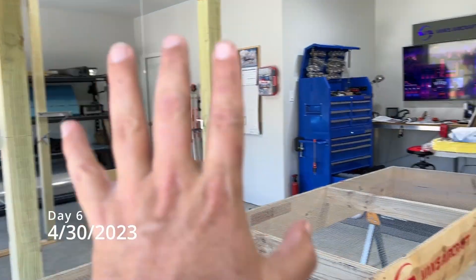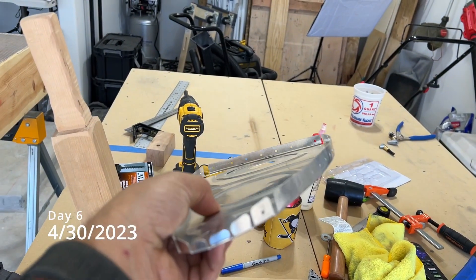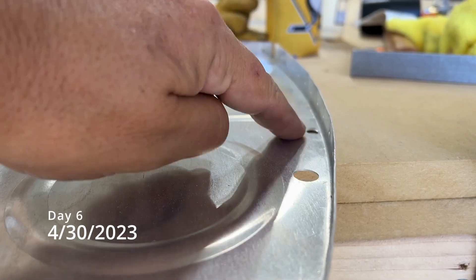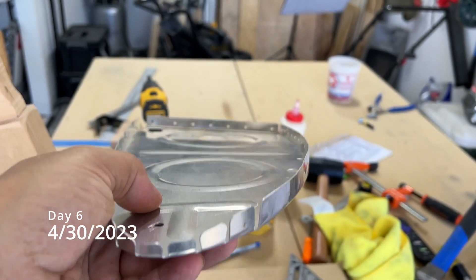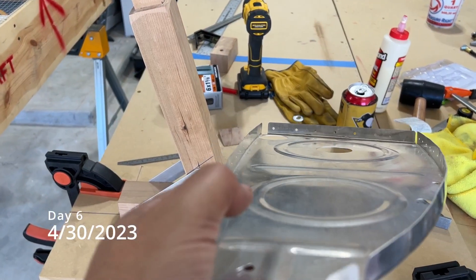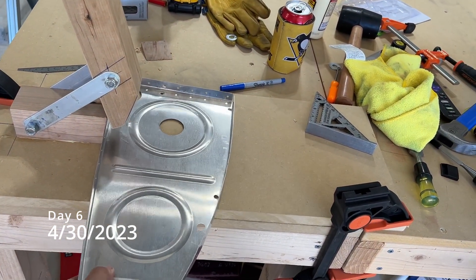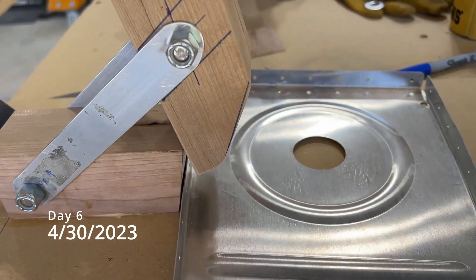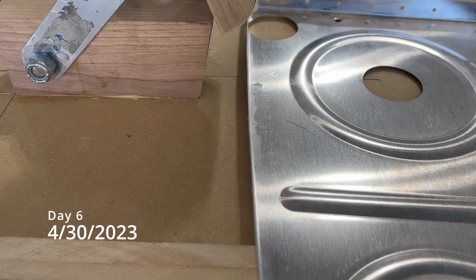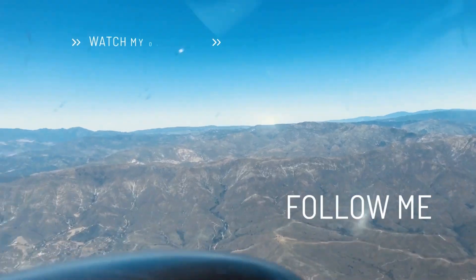Last update on wing building fixtures — I went ahead and built the flange bending tools. These rib flanges, when they come out of the forming block, are often not at 90 degrees to the flange web — they need to be. So you have to go through all of the ribs and correct that, and this tool makes it much easier. There's a back cut here of 11 degrees so that when you grab the rib and pull it in, it will spring back to 90 degrees. Successful — I didn't do a half bad job. Pretty happy with it.